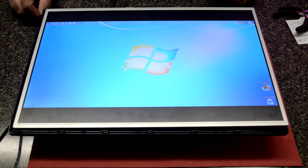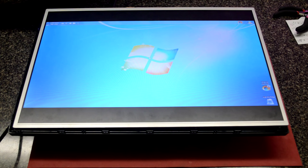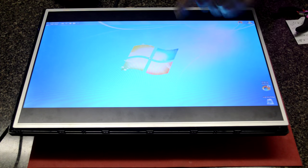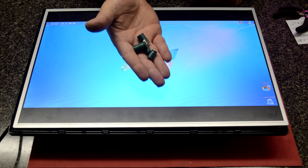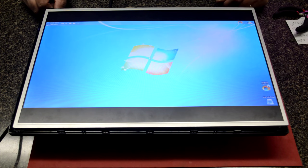Look at that. It's working. I'm going to leave this on for a while and make sure it's okay. I would have to adjust my resolution here, but everything seems to be working and good. So here's your problem. Four bad caps. This isn't unusual for caps to be bad in a monitor. So I'm going to let this run for probably a half hour, and then I'll put the bezel back on and snap it together